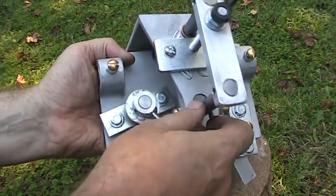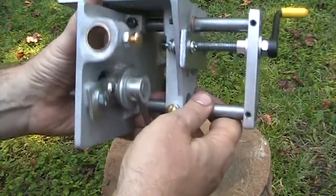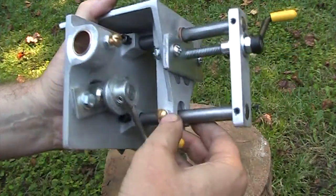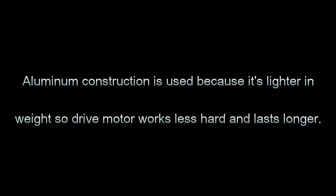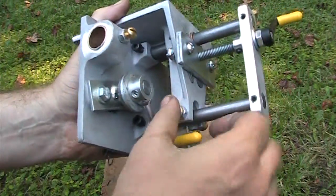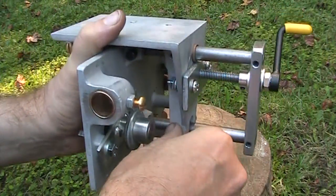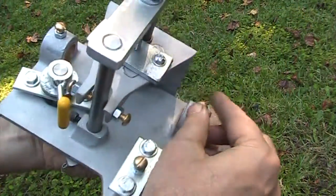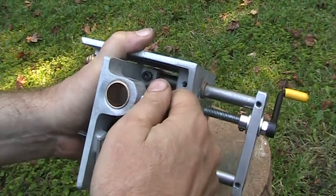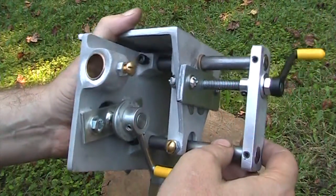The original design is all aluminum and it's got brass bushings here and also here with these screws. This allows you to adjust the vise for slop, so when you get wear you can use these brass components to help tighten the unit up, which is really, really smart.